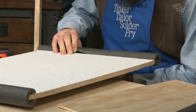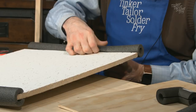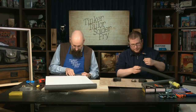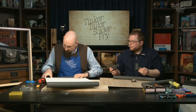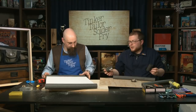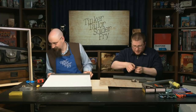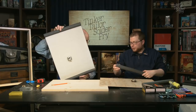I did try an alternative to the pipe wrap foam — softer elbow foam pieces. The idea was a cleaner aesthetic, but the weight of the plywood compressed the softer foam and it wasn't doing the job. The plywood compresses it right down the middle and effectively pinches it flat, so it's not providing any separation. The firmer pipe insulation does exactly what's needed, so no need to reinvent what already works.